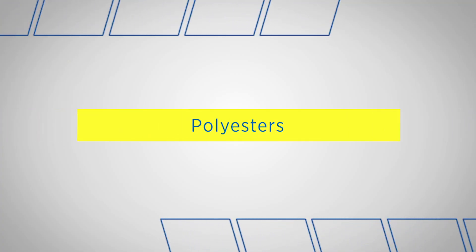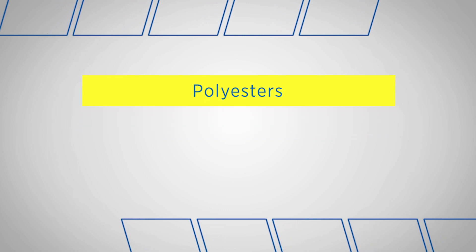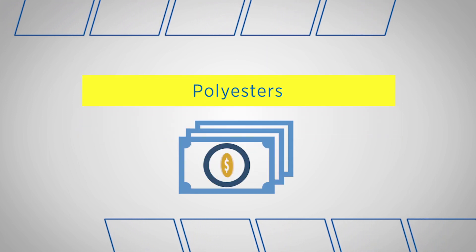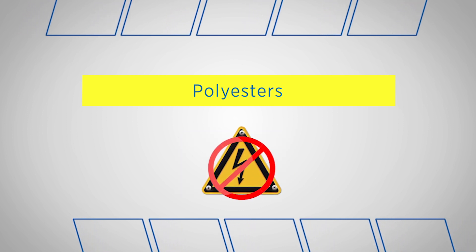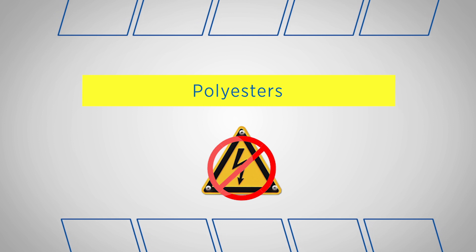The second family, polyesters, have many similarities to nylon. Polyester often comes in at a lower price for the performance. It's most commonly used in non-conductive hoses since it performs better than nylon 6 for that application. Polyesters have different chemical structures than nylons, so for some situations where nylon has chemical compatibility issues, polyester can perform well.